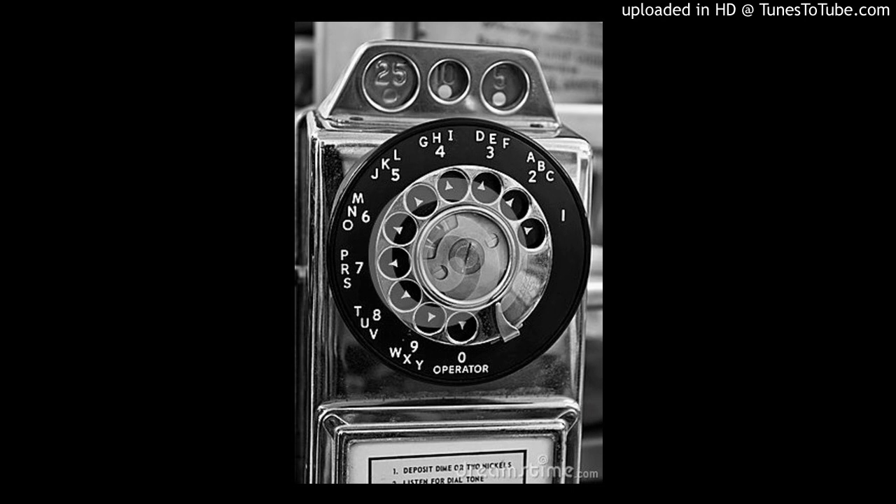Well, it's been quite a trip up and down the East Coast here, but we've actually touched upon every coin control method I've encountered, except for some minor variations in independent dial tone first and semi-DTF — except for one: Harrisonburg, Virginia. As I said, it's not earth-shattering, but it's unique. The Harrisonburg step itself is fairly typical, except for its coin control method, until you get into part two of that series where we start calling into the tributaries and hearing some really weird carrier noise. The Harrisonburg series starts next, and at first it's just a step with weird coin control.